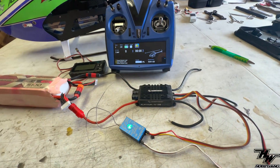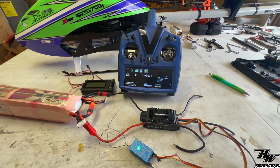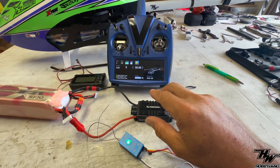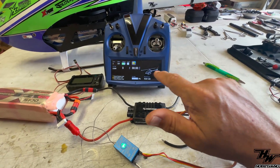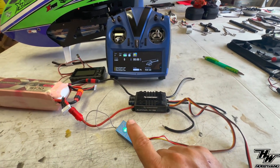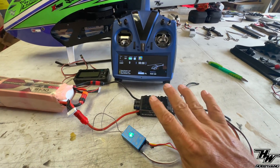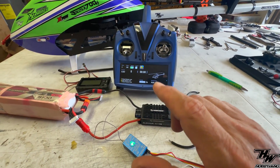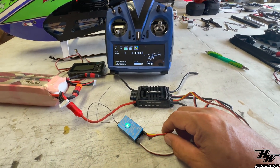What could be missing? The telemetry cable. If the telemetry cable is not plugged in, or is plugged in backwards, you will lose the HobbyWing app. The HobbyWing firmware will still be present and everything may be properly firmware updated, but without that telemetry cable you will not have telemetry.